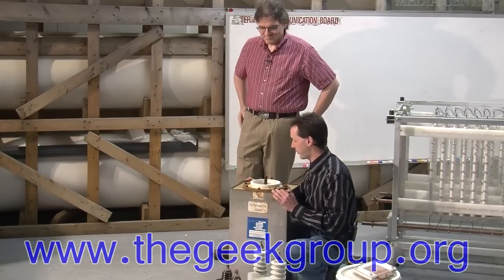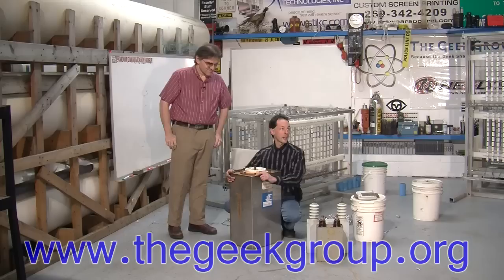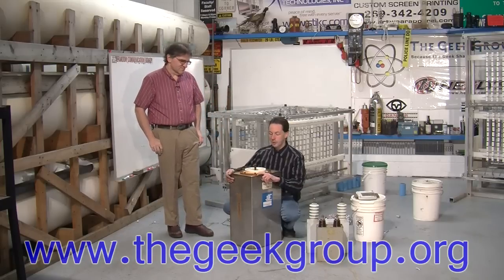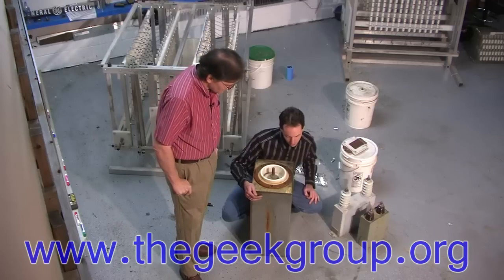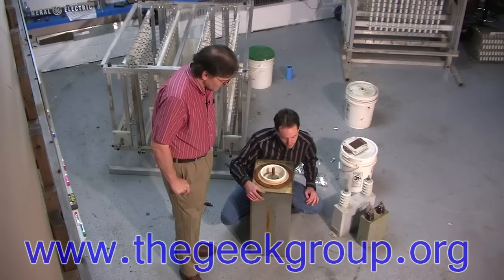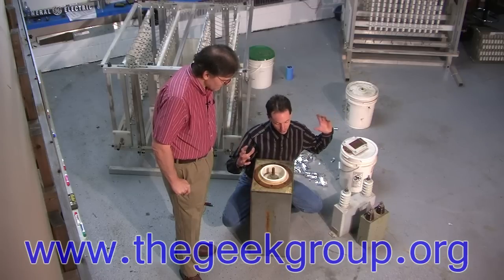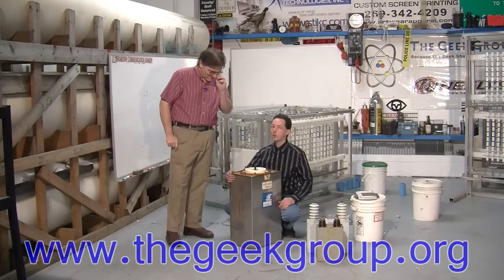Before I go into it, I just want to make a note. You'll notice there's a drain wire on it. There's also a sticker on it. I don't think you'd be able to see the sticker, but the sticker says, "Warning, the energy stored in this capacitor is lethal. To prevent any chance of shock, the capacitor must be discharged before handling." Yeah. They really mean that.